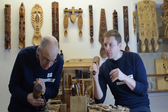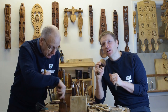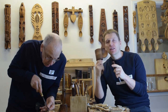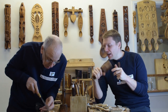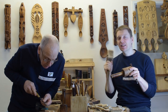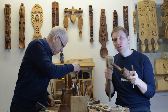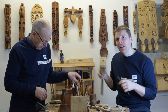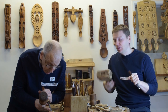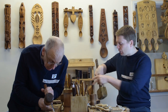As you can see, you can pick it up and use it and it doesn't require a huge amount of accuracy. There's another thing as well — with a square mallet, because you're continually hitting it in the same place, you end up getting a hollow where you're always hitting it, and over time it actually makes it impossible to continue using because of that hollow.